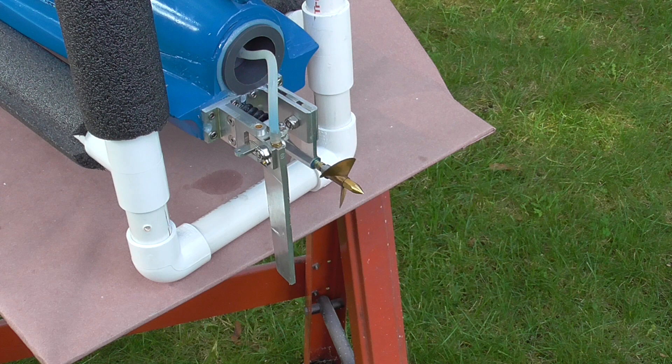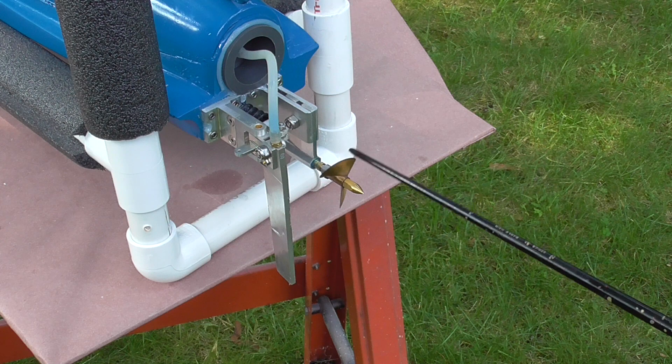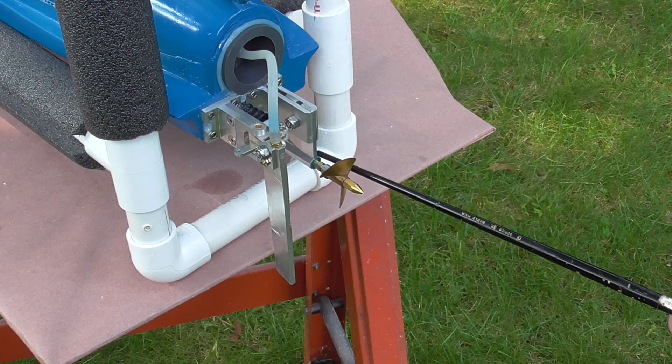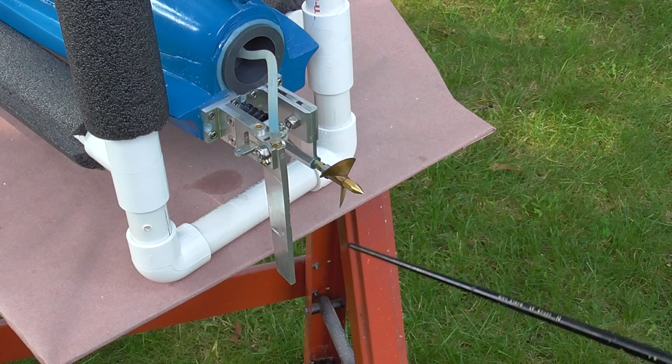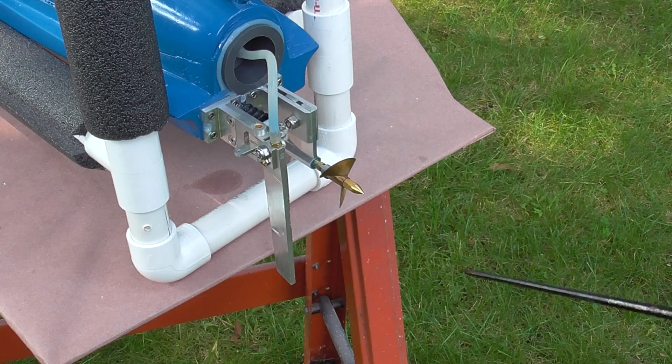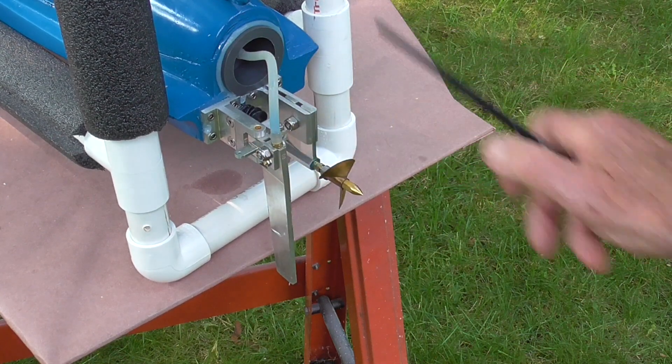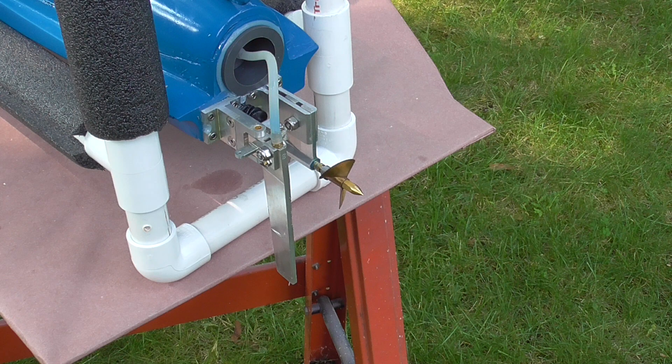Virtually all the parts for the hydroplane propulsion system came from Offshore Electronics in Chelsea, Massachusetts. The propeller was bought pre-balanced — paid extra for that. This is a conventional drive system using 3/16ths drive shaft. The rudder system has a reasonably good swing of motion. Unfortunately, the first time I took the boat out it hit a submerged rock, which caused the rudder to bash back and broke the small breakaway brass screw. It also managed to hit the propeller but fortunately didn't damage it.